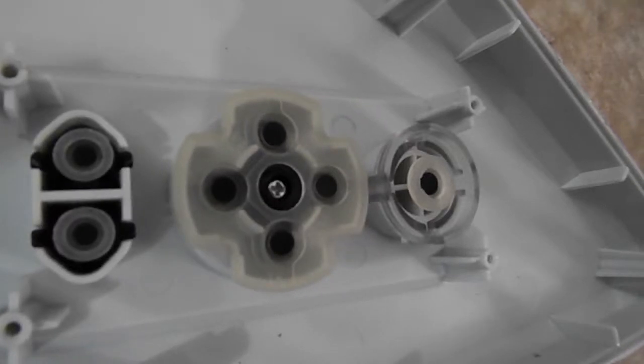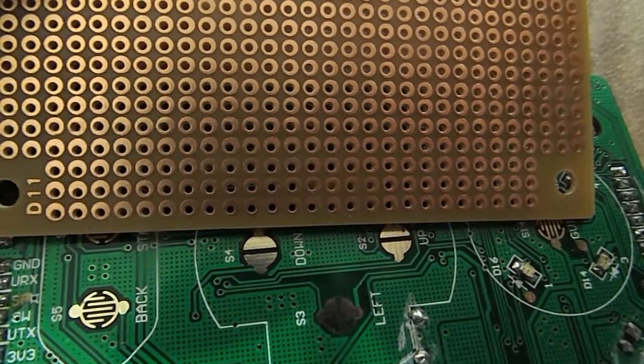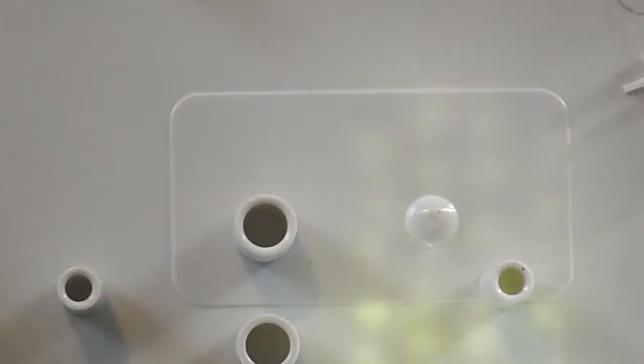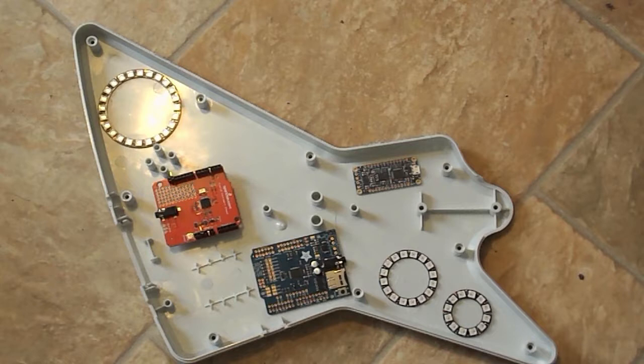The control panel on this guitar is the most sophisticated of the bunch. The other guitars just had simple push buttons, but this guitar has a two-way toggle, a four-way toggle, and a button with a clear cover and four LED indicator lights underneath. I can never hack the board itself, but the spacing of the components is close enough to the hole pitch of a standard perf board that I could theoretically mount some standard clicky switches and reuse the knobs to recreate the same functionality. The case is just translucent enough that I can put in some NeoPixels, an Arduino, a MIDI or soundboard, and even an amplifier. It's a high-quality, sturdy case, easy to work with. So I think this is the guitar I'll keep for my project.